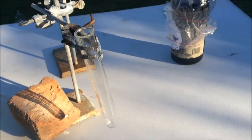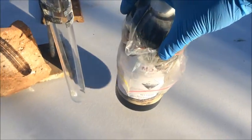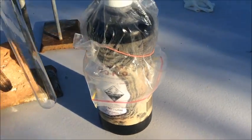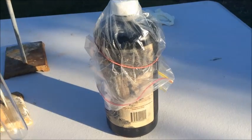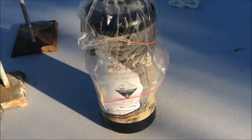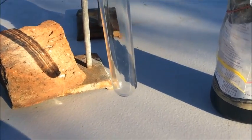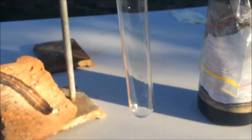So what we're going to do is clean that with some chromic acid. We have some sulfuric acid here. This is my standard Mofo bottle, the black Mofo. It's taken a bit of a pounding recently — you can see the labels are ruined, I assume from water absorption and the sulfuric acid. There's not heaps left, but the plastic's fine, it just looks in a very sorry state. We'll be putting some of it in there and adding some potassium dichromate, putting this into a hot water bath, and see if we can get rid of everything on the sides using this chromic acid.